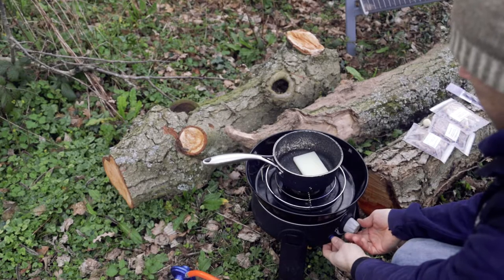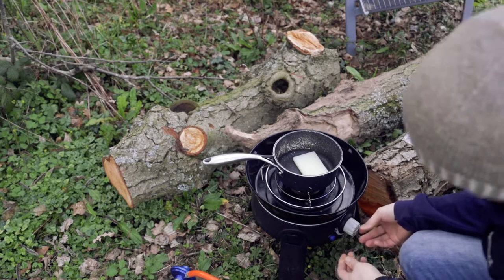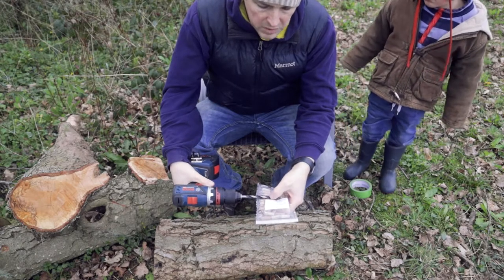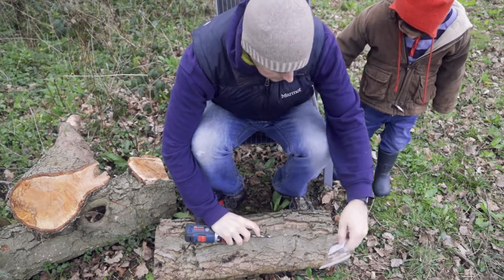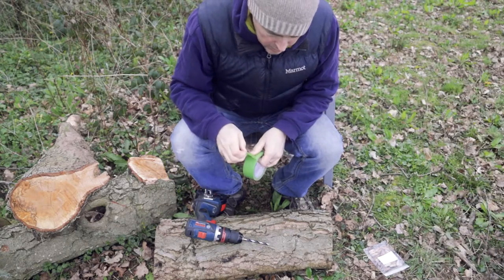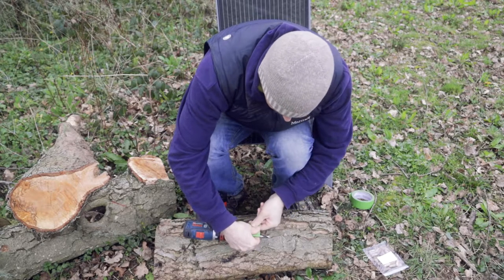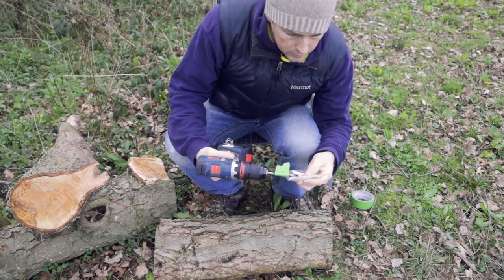While I'm doing the drilling, I'm going to get the wax melting on this camping stove. In order to get the dowels into the wood I need to drill a hole, but the hole needs to be — according to the instructions — about 50% longer than the dowel itself. So I'm going to mark off roughly where that is on my drill bit, then get a bit of tape and tape around there so that I know the right depth. That looks about right.